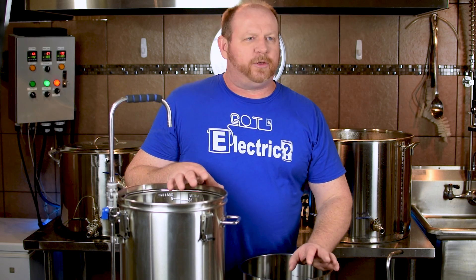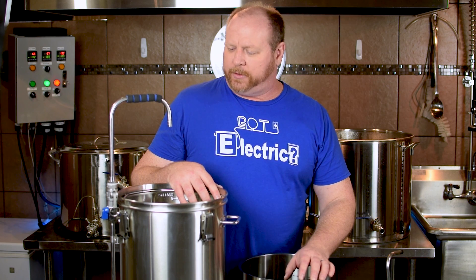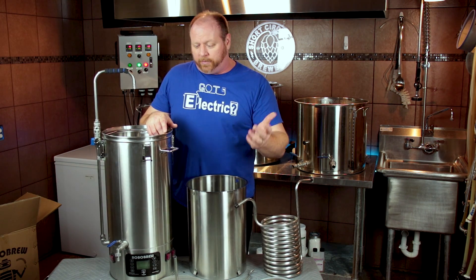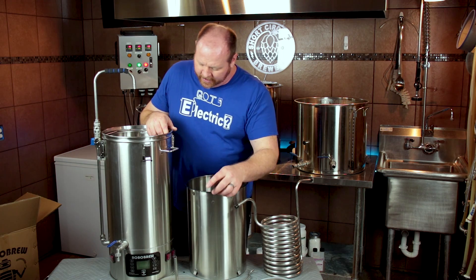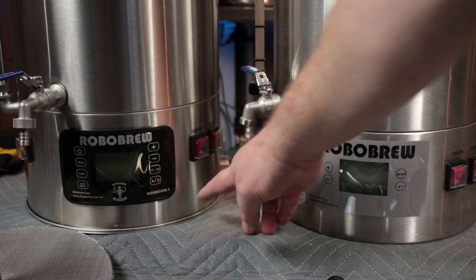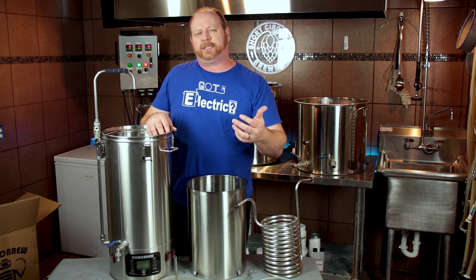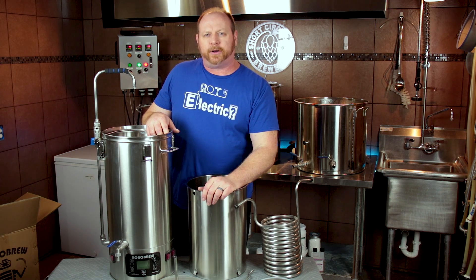All in all, I think they really did a great job and they really listened to the community. I personally had a few conversations with Keg Land and discussed some of the issues I was seeing on the RoboBrew forums on Facebook — the RoboBrew Users Group USA and the Australian or European version. They really addressed a lot of those concerns. I also noticed that the collar on the bottom is a little bit taller now and has a rolled ring around the bottom which gives a little more structural integrity. That additional height on the collar should also provide more airflow, since a few people had issues with the pumps and controller — hopefully giving a bit more longevity.